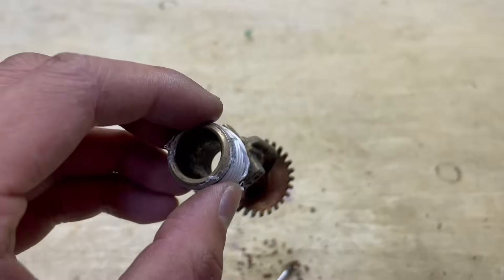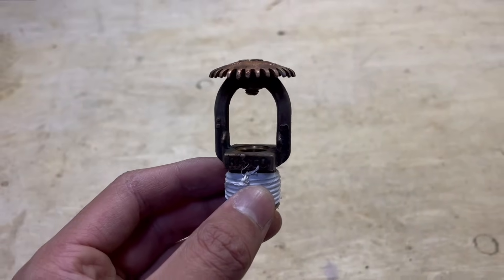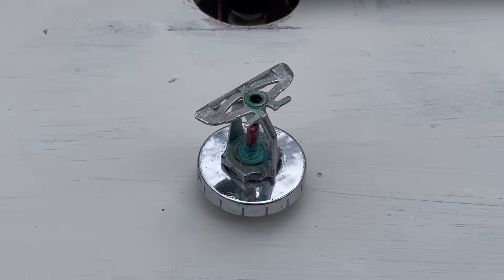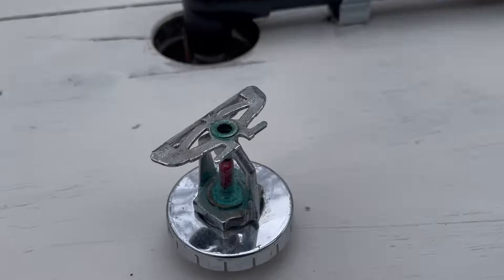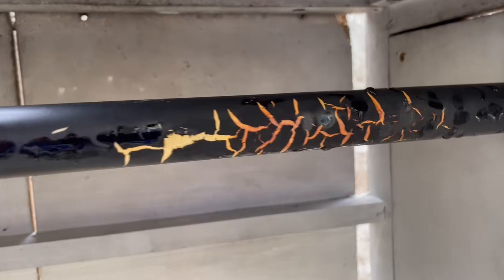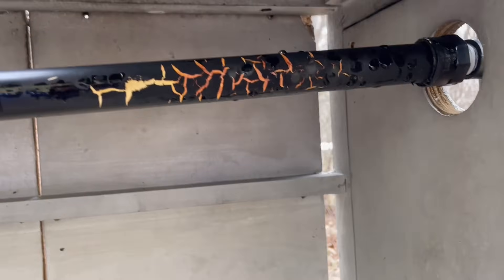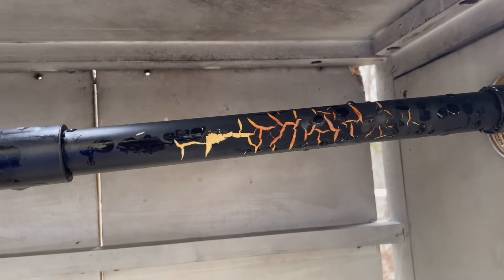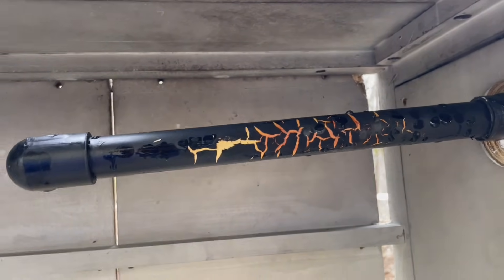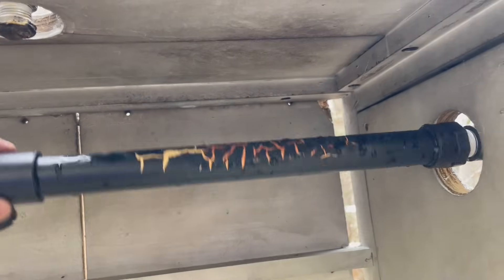That's why you want to replace sprinkler heads when they show signs of trouble — on the outside they might not look too bad, but inside there might be bigger issues. The last sprinkler head I'm going to test today is the sidewall sprinkler head. You can see it has corrosion on it. Also, right here on the pipe I was just using for the upright sprinkler head, you can see that the paint on the bottom literally melted off because of how hot the fire got. It just goes to show that without fire sprinkler protection a fire can get out of control really fast, and a failed fire sprinkler could be devastating for your facility.